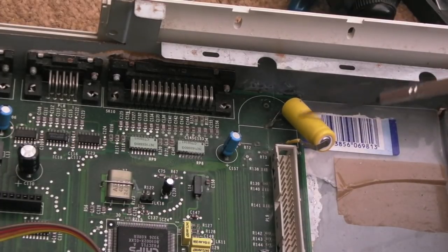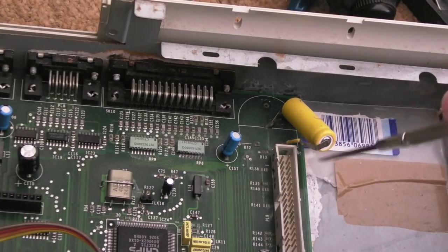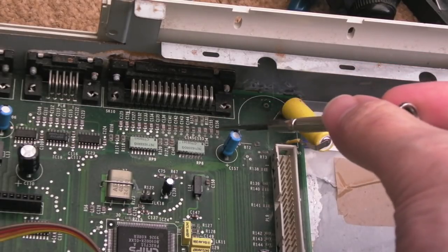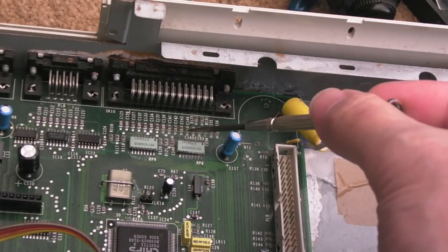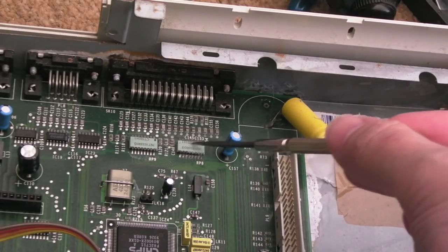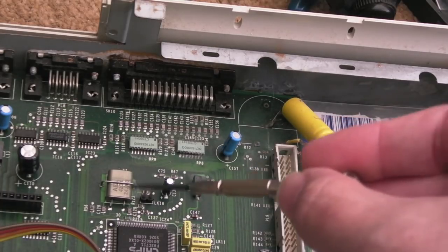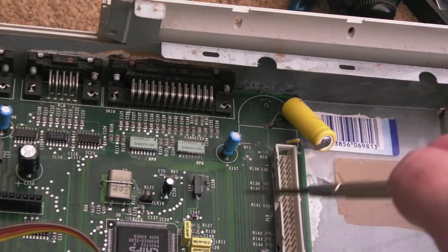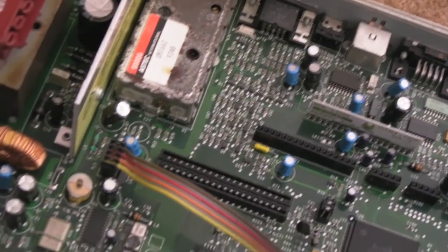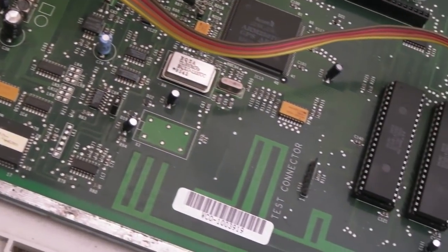With this one we've got a crazy battery installed - we'll remove that. There is some corrosion on the components around here, so I wouldn't be surprised if the floppy drive is playing up. I've got some caps so I can replace them here, maybe clean up those ones - these ones here are worse affected. There's a resistor pack, RP8 - the contacts look awful; I'd certainly clean those up and maybe try to reflow them. The rest of the board looks okay, just a little bit of corrosion on top of the modulator shield.